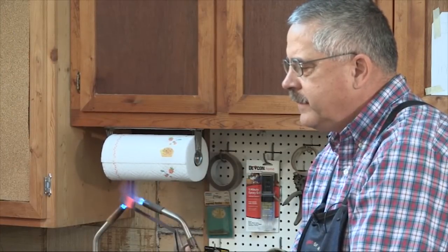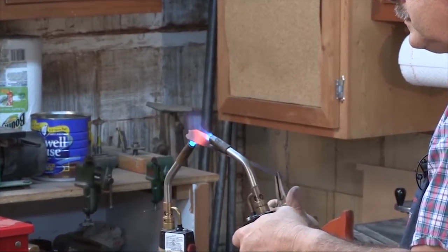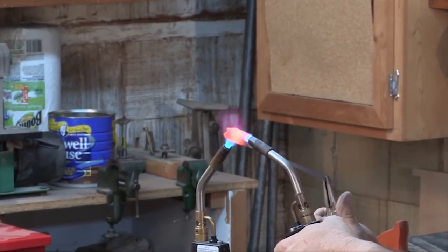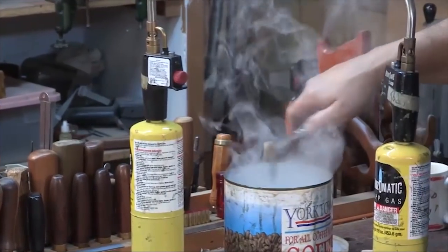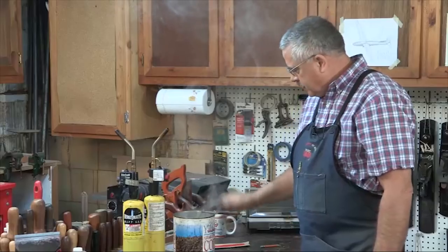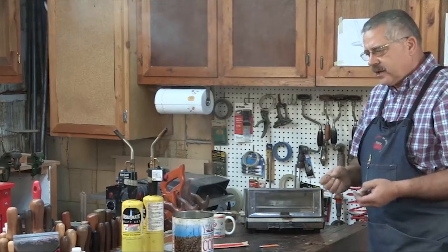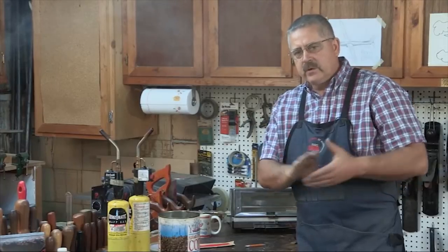Try to get a uniform color now, taking it out to the cutting edge. We'll let that cool, pop it in our oven for an hour, take it out — it'll have a light straw color to it. We'll clean it on the surface plate and then do our final grind.